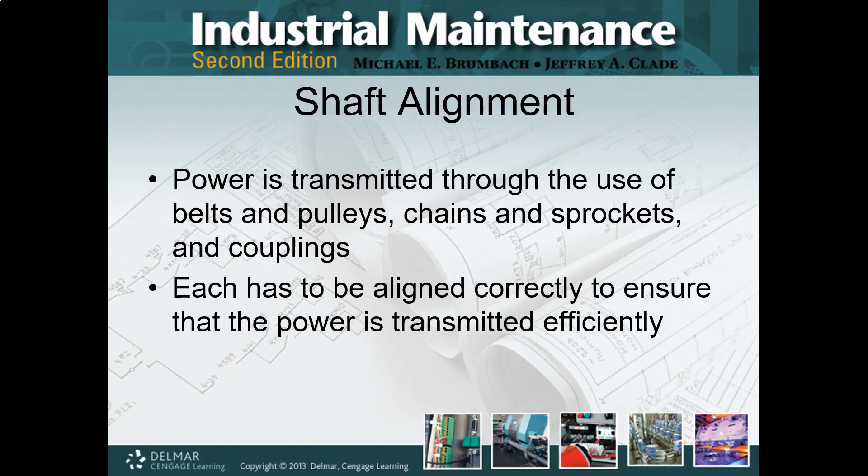For bearings, if you recall back to bearings, I said that one of the items that could put more load on a bearing than would normally be present during normal operations is misalignment — misalignment of the shaft, pulleys, belts, whatnot. Misalignment is huge.